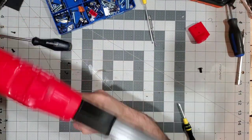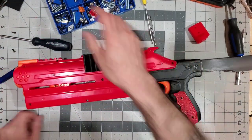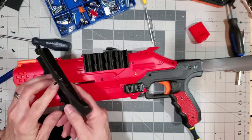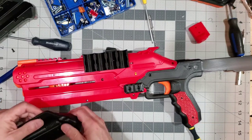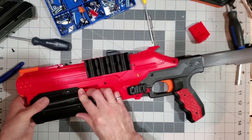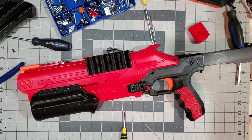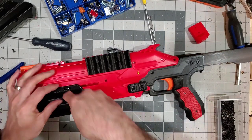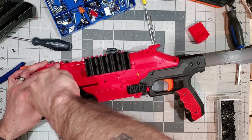That's the pistol grip with the scales. I have a three-slot Picatinny rail made and put on for a sling point. Next is the pump grip. In my design I've used an M4 x 12mm screw to interface with the bolt sled — these will come pre-assembled as well, they just drop in. You will need these long screws here that screw right into the bolt sled — they're M2.6 x 12mm tapered tip, in case you ever need to order any for yourself.